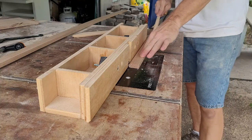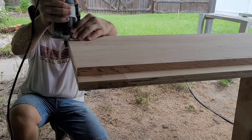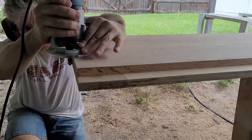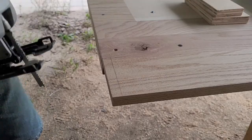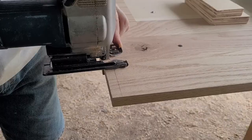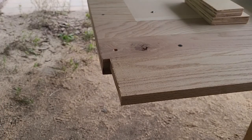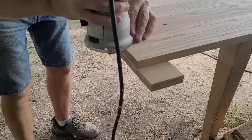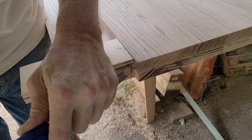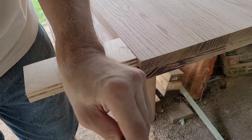Before fitting the trim and moldings, I decided to clean up the end grain on the top assembly. A flush trim bit in my palm router and the two edges were nice and smooth. On one end of the bar the trim is flush with the bar side, so for the drip edge to look right I had to remove a section of the glass rail. After laying out the size of the drip edge, I cut out most of the stock with my jigsaw, then set up two straight edges to follow with my pattern bit. A few taps on the chisel squared up the corner. I decided to mount the bar rail before fitting the drip edge, so we'll come back to this later.